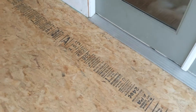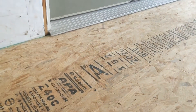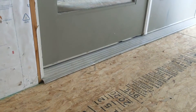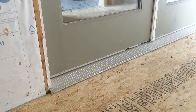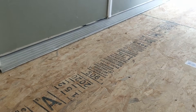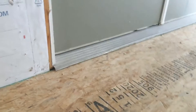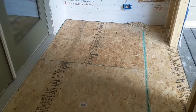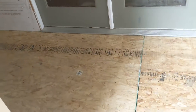We're right at grade. The thing I'm worried about is I put two layers of subfloor in here. As you can see, there is wood flooring inside there. Once I put the half-inch hardy board down, then you do mortar and tile, my flooring is going to be — it may actually end up being higher than that wood floor in there. Just kind of worrisome. But it's not going to move. I guess that doesn't make too big of a difference, but I usually try to make your transitions as smooth as possible so you don't create a trip hazard.